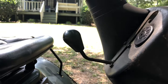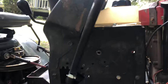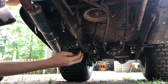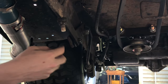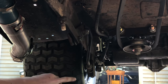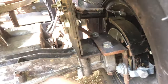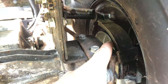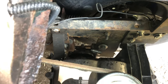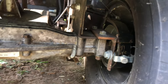I mainly use the transaxle brake as a parking brake. The main brake is actually a drum brake system from the deck lever — it works like a handbrake. I made it from a piece of 3/16ths flat bar with a slot cut in it. A bolt slides up the flat bar and pivots, with a piece of linkage pushing back on angle iron. When the lever is pushed in, it pulls the top band on a drum brake that I welded onto the shaft, with band retainers — that's my main brake. You can see the band getting pulled when it's engaged.